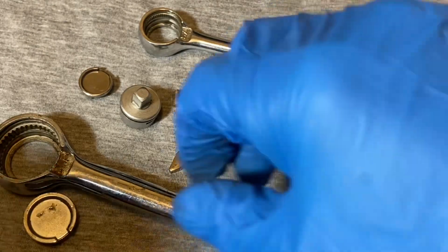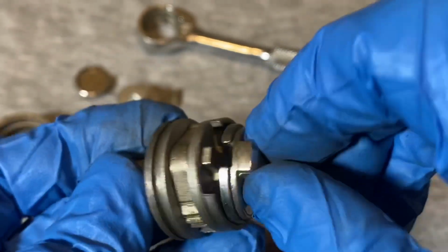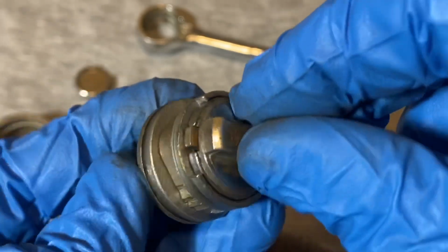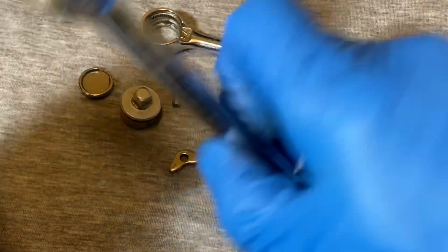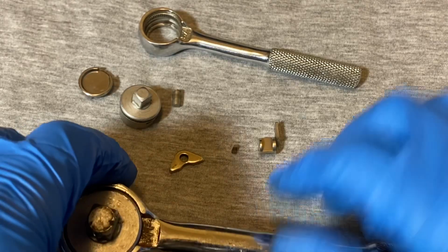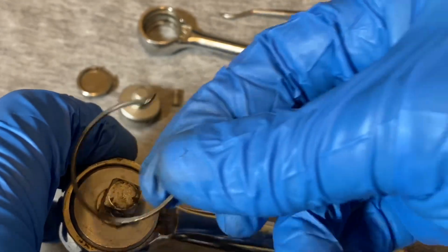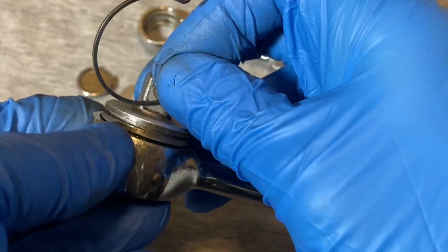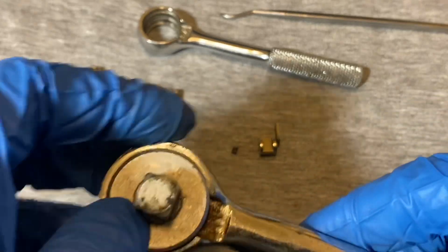Yep, it's switching. And you take your switch, put it on with the cutout corresponding to the top of the switch like that. And I put it in the middle to get the pawls out of the way. That makes it a lot easier to get into the mechanism. And then you just take your retention ring, and you put it around the edge in the channel there, and you compress it, and that's how it all comes together.